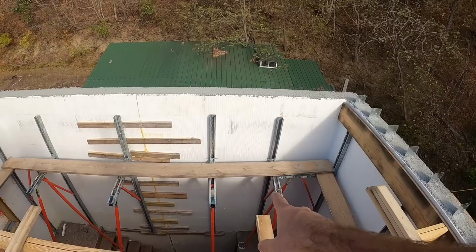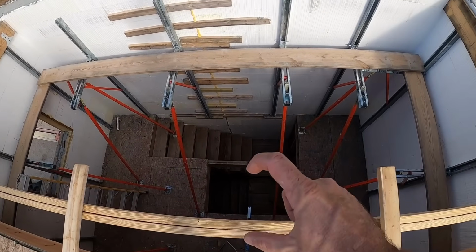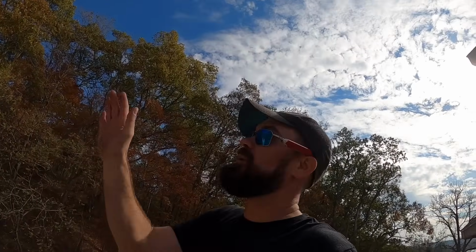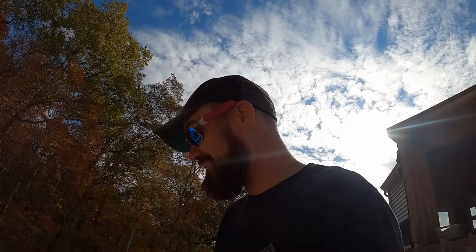We've got our platforms drawn on the wall where those would hit, and we're pretty confident of our distances. The biggest issue is to keep the steps 39 and a half inches the entire way and not shrinking your platforms. Again, everyone, keeping in mind, I want to be able to get things up here and into this top portion without it being a major struggle. A mattress, I believe you're going to be able to turn up and spin if this were to be a bedroom, for example. Coming up with tables and chairs, you can take the legs off of them and stand the top of the table up. You can take the chair and you can rotate it around those 90s. But if those platforms got smaller, it'd be really hard to do. So, yeah, I really don't know how this is going to tie together, to be honest with you guys.